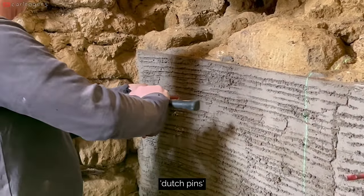And after a quick 40 grit sand, I measured how long I'd need to cut the beam so that it overhangs the concrete pad by 150mm or so. And it was almost exactly 3 meters if I remember correctly, so the top and bottom flights would each have to be just under 1.5 meter wide.